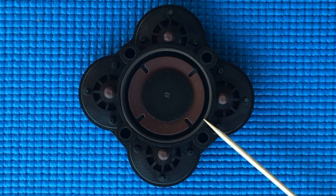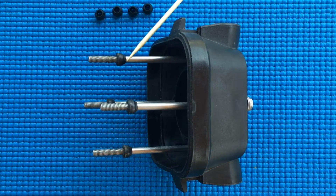Make sure that the small Viton O-ring is properly seated in the center of the valve block. If necessary, replace the four bushings with the new ones that came with the valve kit. Note the bushings have a taper on one end — make sure the taper faces the same direction as the old ones, toward the pump's upper housing.